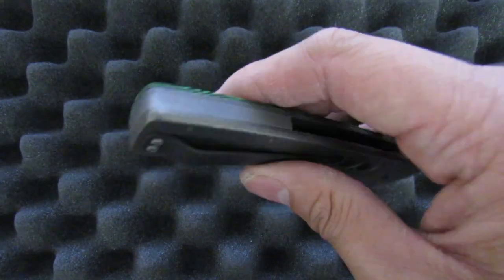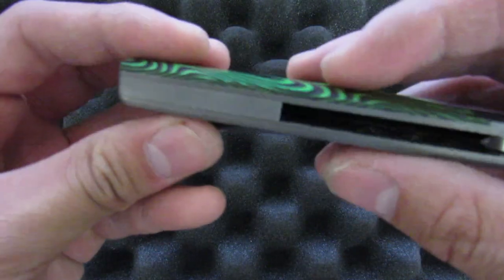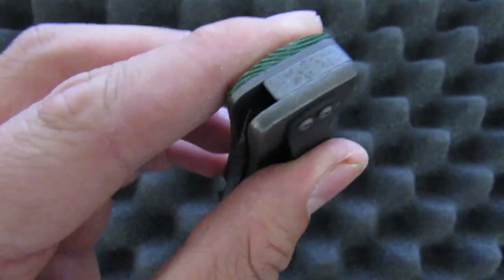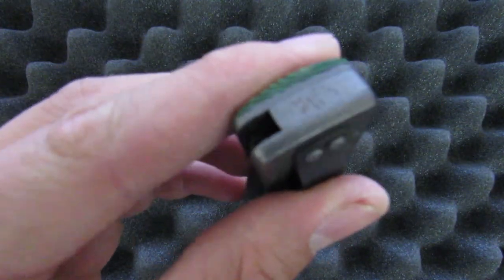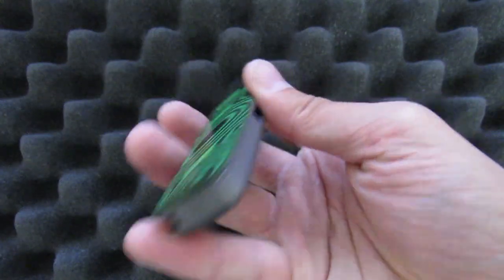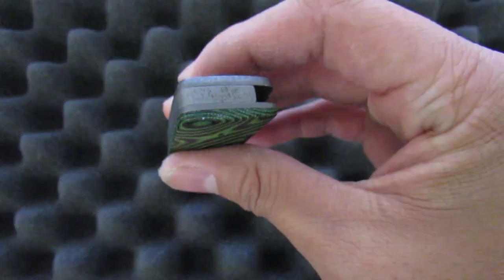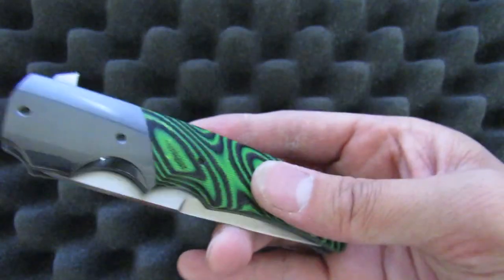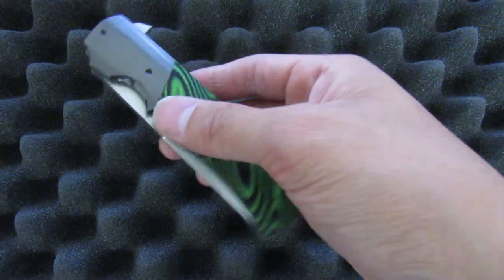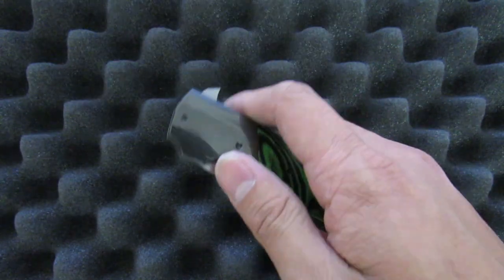That backspacer could be titanium, but I suspect it's just steel — it looks different from the titanium liner and lock side, it just kind of has a different tone to it. And back here, I think this could be rust on the back. I'm actually not sure, but if it is rust, it was probably made worse by the working finish on it. I can't say I'm a huge fan of having a blasted steel backspacer for that exact reason — blasting opens up the pores in the steel and just makes it less corrosion resistant. Having that on the part that's normally contacting you just doesn't really make much sense to me.